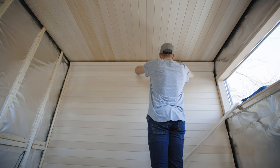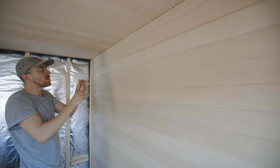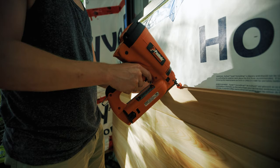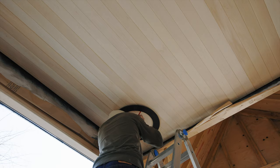I think it's just funny that obviously Finnish hospitals have saunas. I've had some saunas where I left feeling kind of stuffy and puffy-eyed — I think they were pine or cedar — but aspen is a safe bet for any guests. If somebody has a rare allergen to cedar they won't have a problem with this. I also like how it doesn't split like cedar does. You can't just wail on cedar, but I can just hammer the tongues with a mallet and they don't break. Cedar definitely would break, so it's great to work with and it looks good.